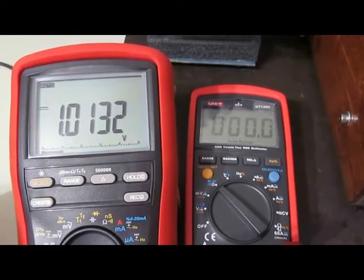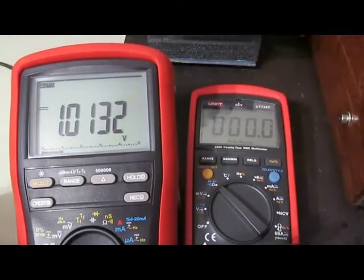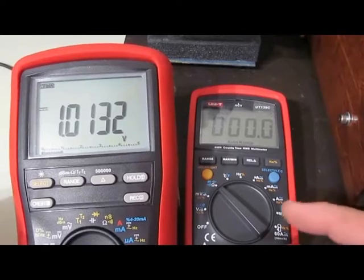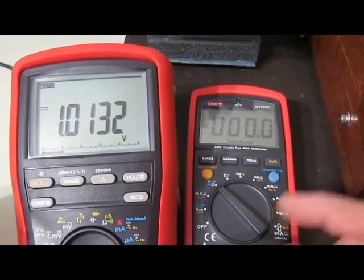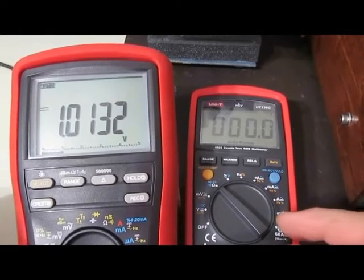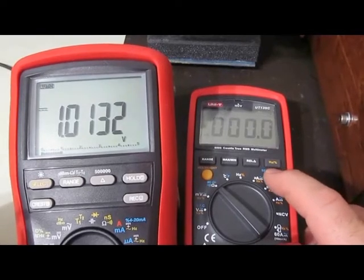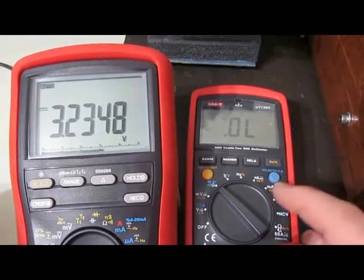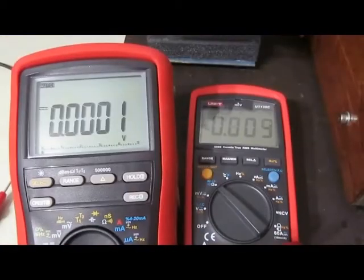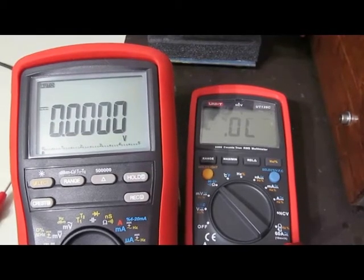The two diodes that I had replaced right here, these are both shorted, and it clamped it basically to the rail. I checked both rails that those clamped to, and those seem correct, so no damage there. So after changing out the diodes again, this voltage came back to normal. You can see here it reads a short in continuity. The diode check, though, actually works now. So this is with a dead short and open.